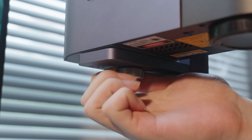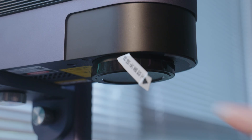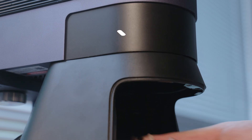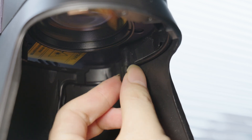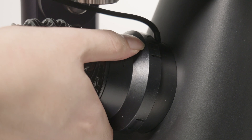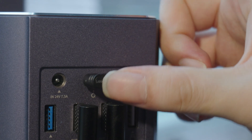The laser unit is secured to the motorized bracket by turning the knob on the bracket. Next, use a spirit level to ensure the laser unit and base plate are relatively horizontal. When installing the conical shield, the laser shield needs to be removed first, then the mounting position can be easily found. Tighten the two screws underneath and cover the orange-colored shield. Finally, link the exhaust pipe to the fan on the back, connect the motorized stand to the laser transmitter using the included USB cable, connect the power supply of the cover to the USB port, and insert the security key into the mini USB port — otherwise the machine will not work properly.